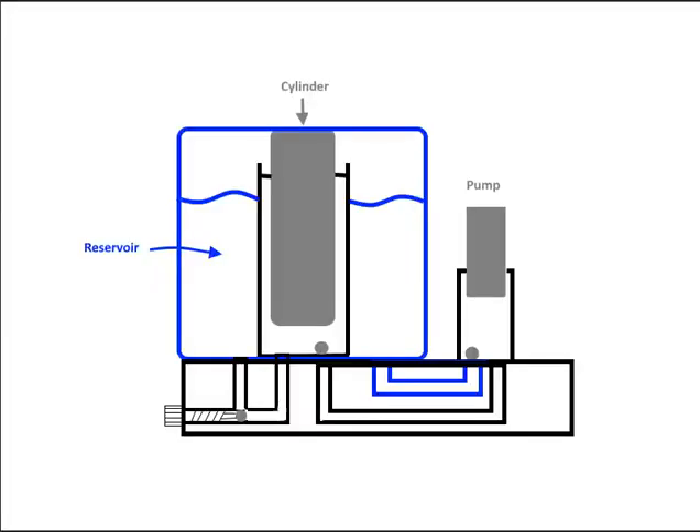Let's take a look at how the hydraulic jack works — this will give you a good idea of what we have to do to make it work upside down. We have a reservoir shown in blue with our oil levels, we have our cylinder which actually goes above the reservoir, we have our pump on this side, a valve here, another valve, ball bearings, and our bleed valve here. This is our release: when we want to release pressure it comes back this way.